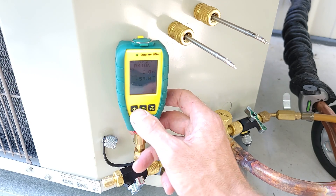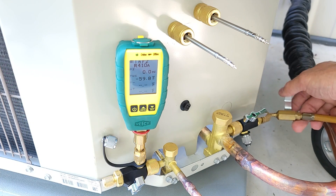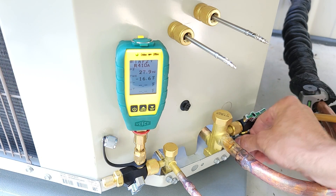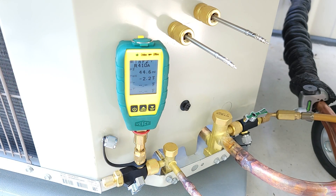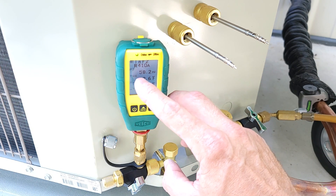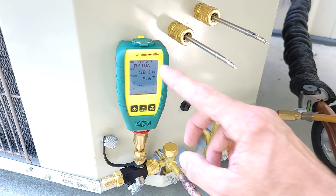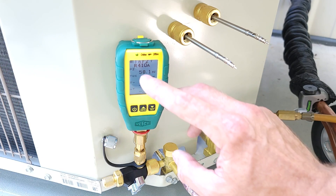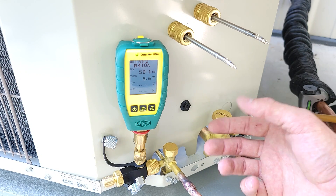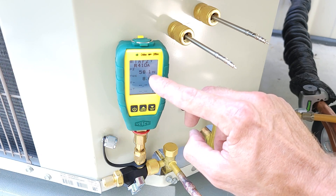Our pressure is going to be right here. We're only pressure testing up to about 50 PSI first. If there's a leak inside or outside, you don't want to waste 200 PSI of nitrogen. We're just pressure testing up to 58 PSI first — you see it's not moving, so we don't have any small leaks anywhere. We don't have to go run inside because we have a digital gauge and we're very precise with our measurements — we're in tenths of a PSI.